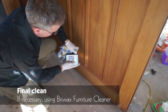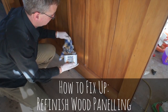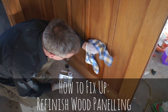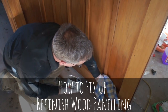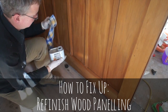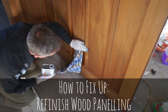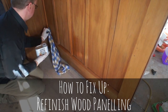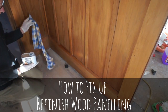Now we've stripped and reassembled all the wood. To get rid of any final marks, we're using furniture cleaner — this is a very strong solvent. It will clean off any grease, muck, and oils left behind from the timber, and it will dry very quickly. Make sure you have plenty of ventilation when you're using this. It's not absolutely necessary, but it allows you to get rid of any final marks and get the surface completely clean. Also use this if you've got new timber.